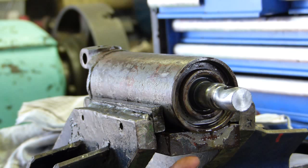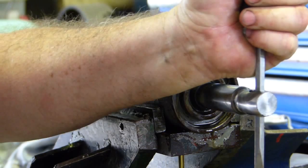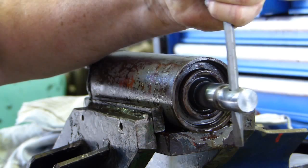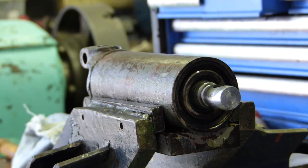I've turned the ram upside down — the valve used to be on top but it's now at the bottom with the ports open and a pot on the ground to catch the oil. The flat here helps hold it from turning. What I like to do now while that pot's there is manually pull the ram in and out. That drains any oil out and makes it a bit tidier when you pull it apart — you don't want oil flying all over the bench.